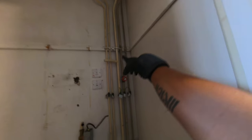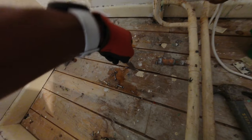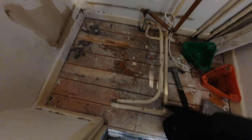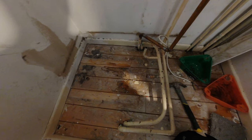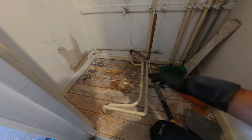I've cut off all the vent pipes, the old cold feed, and the hot water feed up there as well. But these floorboards are a nightmare — they're tongue and groove, so it's not as easy as just lifting them up. I've got to get the multi-tool out and cut the tongues out, then see what section I can lift up. Considering the way the joists are running — hopefully that should give me a free run to get this over to there and link it out straight underneath. If the joists are going the other way it's going to be a little bit more work, but I'm going to start by cutting the tongues out, take a couple of boards, and see what's what.